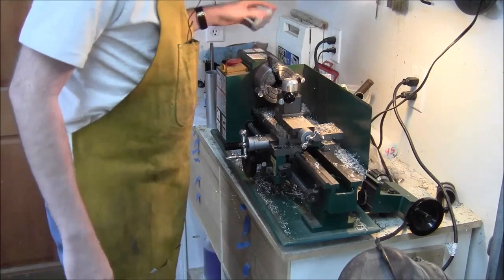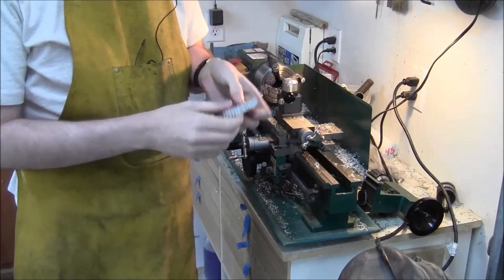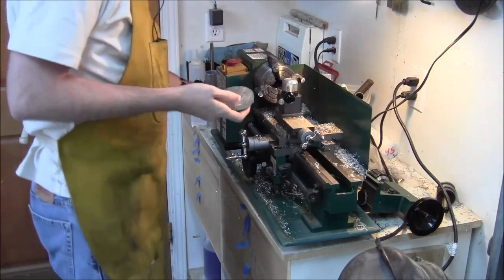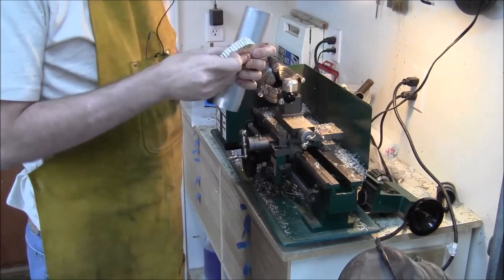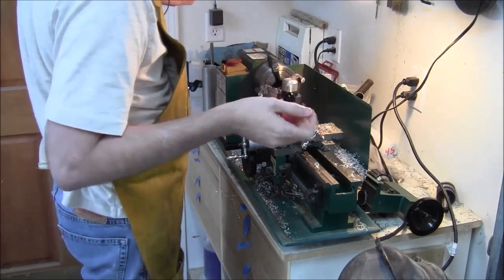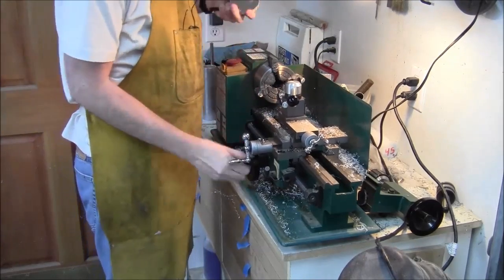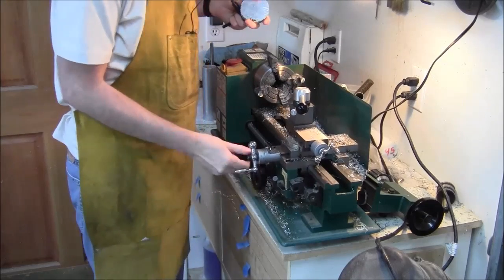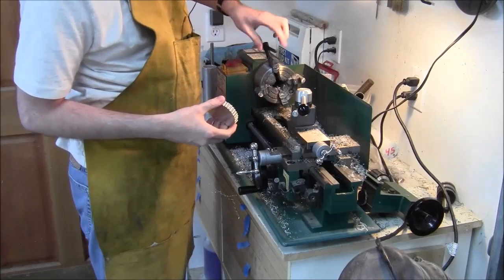Okay, so what I'm going to do is bore this and leave about an eighth of an inch as a cap. I'm going to bore it for this to go on, and then I'll use a set screw on the end as a cap. I think that's going to work. We'll find out. I'm going to continue with my four-jaw because it's mounted, and to kind of dig the new chuck. But we're going to get this a lot closer to